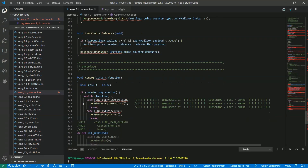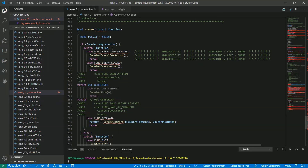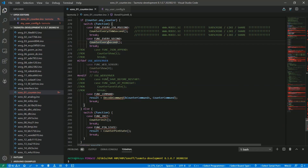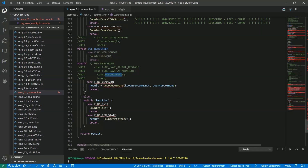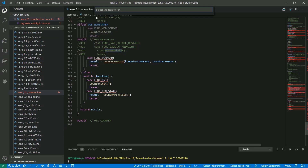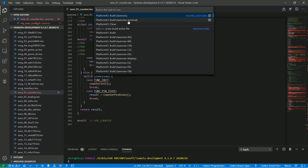The last thing to add is a case call in the XNS01 function — add these three lines as a call to the function we discussed above. Follow by commenting out the lines here. We have nothing to report and nothing to save. At this point, find under the terminal the run task option. Find useful commands like clean, build minimal, or build tasmota. Both builds will come in handy in the next chapters.